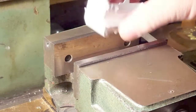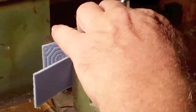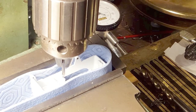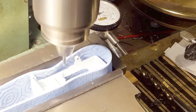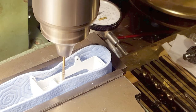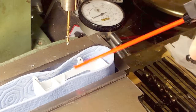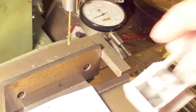I'm going with the Tamiya white primer — the fine surface primer — that's the best primer I've ever found. I've given it a nice coat of primer and it's beautiful. Now I'm going to prepare what was a rivet — drill the stud out and thread it for a 4-40 button hex socket head cap screw. I'm drilling it out and putting cutting oil in there so the material doesn't stick to the drill and break off the end. Since doing this I haven't broken my drill and it's been successful.